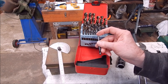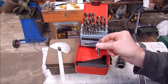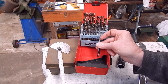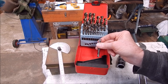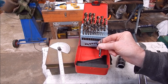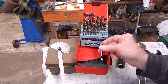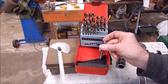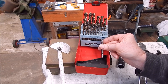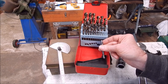Any spot drill really should be a wider angle — or at least as wide — as the drill angle you're using. So if I machine some up to 130 degrees and the drills I'm using are say 110 or 100, it's not going to matter really, because the spot drill will still do its job. So today's job is: I'm going to salvage some old center drills and some broken drills, using that little DC-powered 775 grinder. I'm going to rework the ends of the broken drills so they are symmetrical, then grind a bit of back relief, and they'll be okay as spot drills.